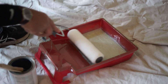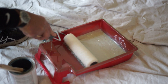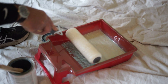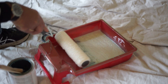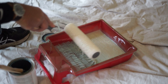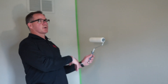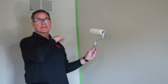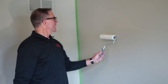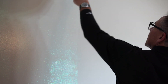Now you want to start by fully coating the roller. Remember how it's kind of goopy? You want to make sure that you get a nice, even coat on the body of the roller, then get rid of any excess, and now we're ready to start applying it to the wall. We're going to start by going vertically with the application, and then once that dries, we'll come back and go horizontally.